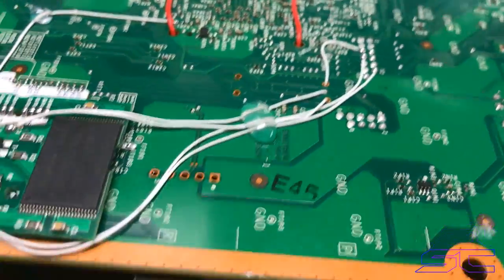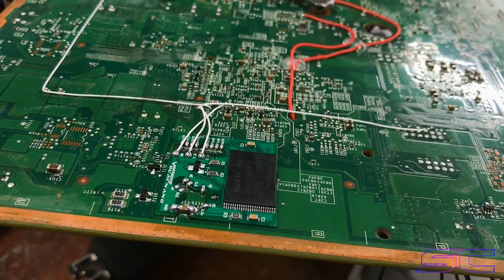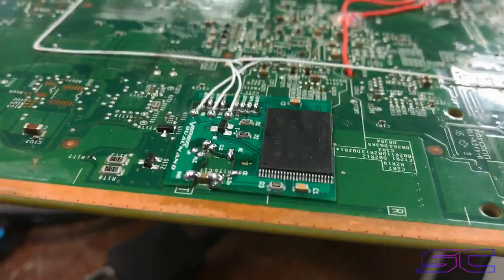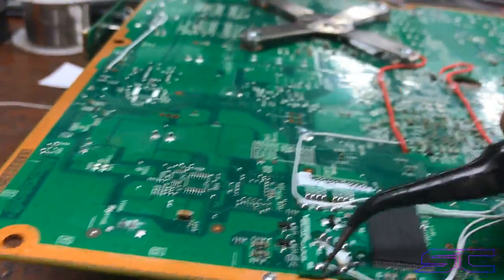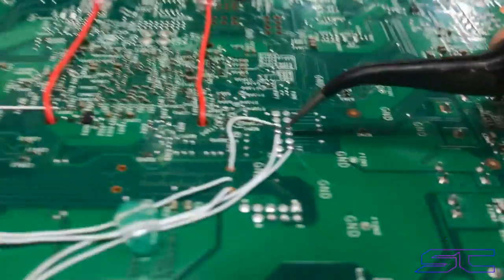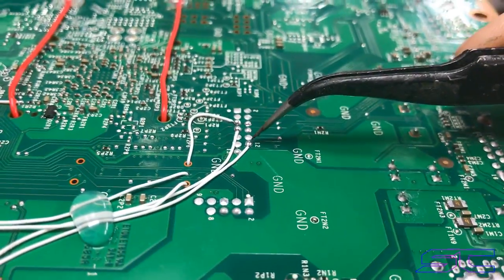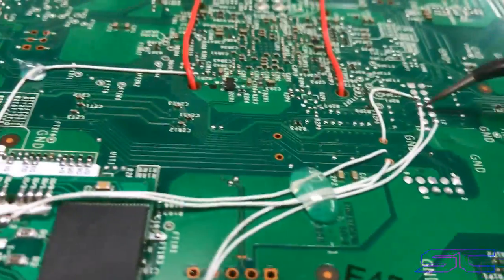SMC is the same. Let me show you a Trinity install so you guys can compare the differences. As you can see, the Trinity has a resistor right there, and the Corona doesn't have that. So I have to take the Corona and wire these two wires up. This is the 3v3 right here, and this is the ground. It's pretty much that simple — you can take a multimeter and figure out which pad is which.